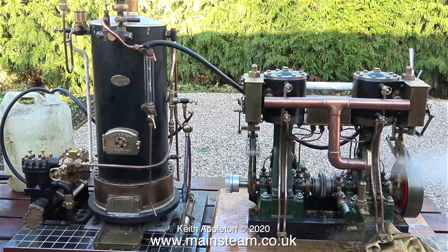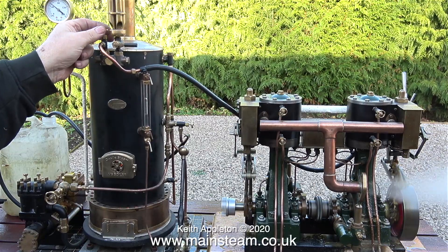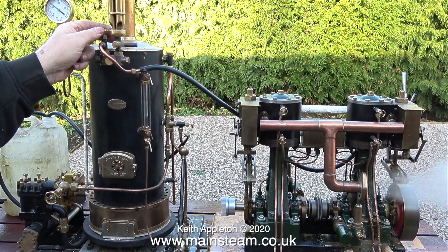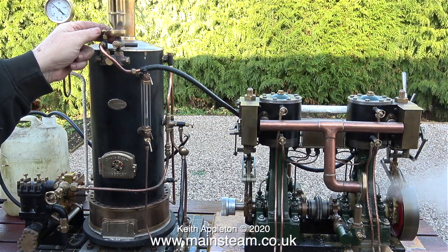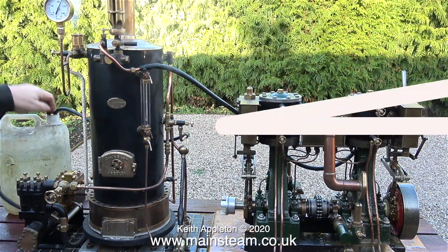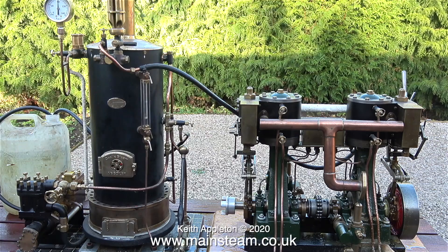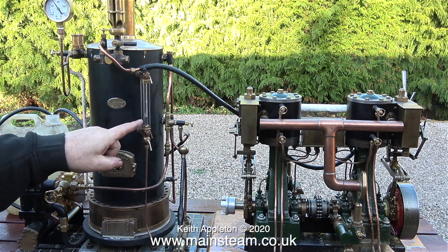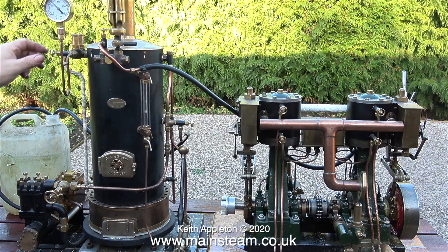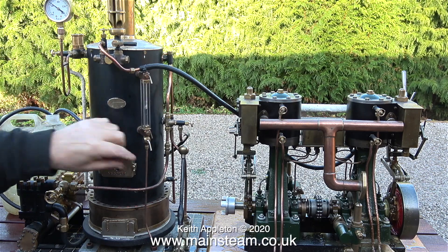I've moved the position of the camera here and you can clearly see the pressure is dropping fast on the pressure gauge. These Castle V6 boilers really are very good, and frequently viewers send me emails saying that they cannot contact Castle Steam — that is because they are so busy. But if you wish to buy one, keep trying because they really are good. Here the pressure's nearly back at 100 psi — a quick burst on the whistle, but be aware that blowing the whistle also uses steam, as well as the engine. If the safety valves blow off they use a lot. So once again I'm refilling the boiler using the steam pump — I'm really glad I've got this, it would be a real pain using the hand pump all the time.